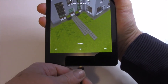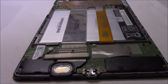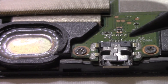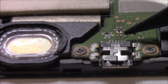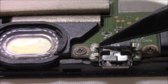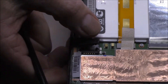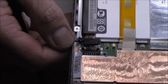So I may have to change the actual port itself. Just to give you an idea of the task at hand — this is how small this component actually is. That's the charging port we need to replace, this component here. Notice one, two, three, four, five — five or six pins — and how small they are. These are the ones that have got to be soldered into place, including these four bracing or earthing ones that hold the actual charge port in place. So as you can appreciate, it's not a small task. Before going any further, it's a good idea to remove the battery connector itself to stop any shorting from happening. That just clips into place, so you just lift that up with your spudger, get under there and flip it up, and that will stop any shorting issues.